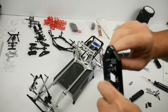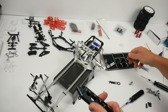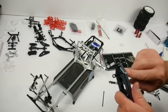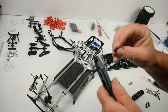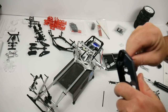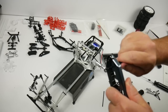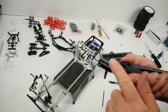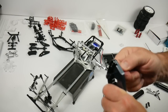The other one is about 54 millimeters, so quite a big difference. I don't really worry about tightening it all the way down and backing it off. This is going to be kind of a show piece, so I'm not going to stress it too much — we'll definitely do a first run. This is a vintage re-release and we're going to pay it its homage. Keep in mind when building these turnbuckles: there's a wide opening and a tight opening, and both wide openings have to be on the same side.